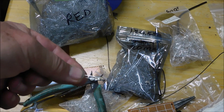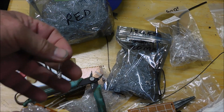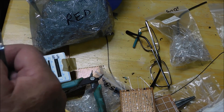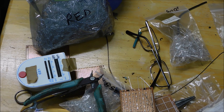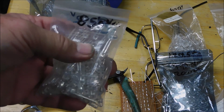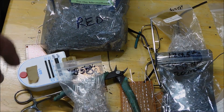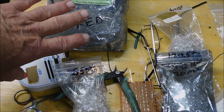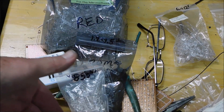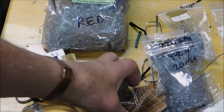I have two different sizes: the five millimeter and some three millimeter. It doesn't really matter what size they are; what does matter is the frequency of light. I have some 940 nanometer and I have some 850 nanometer LEDs — that's far infrared. The 850s are what they call near infrared. And I also have just plain old visible red. I'm not sure what frequency those are; it's insignificant. But the 940s and 850s are the most important for deep healing — light penetration into the skin, down into the bones. The 940s are definitely a must-have.